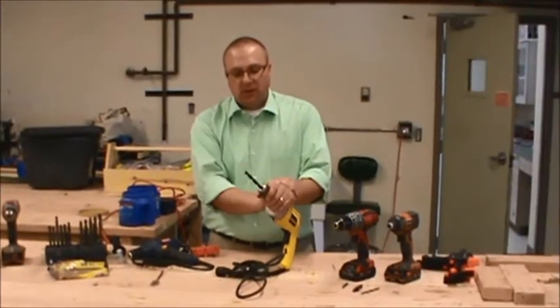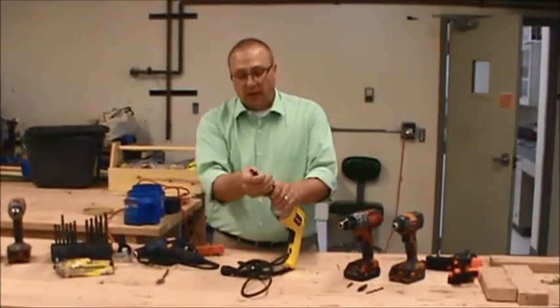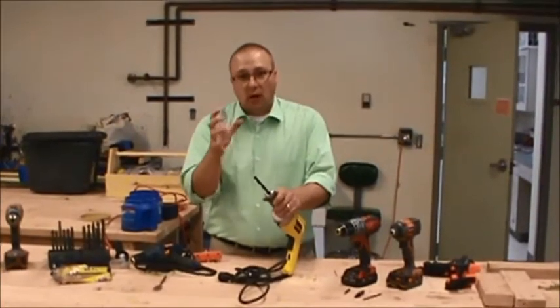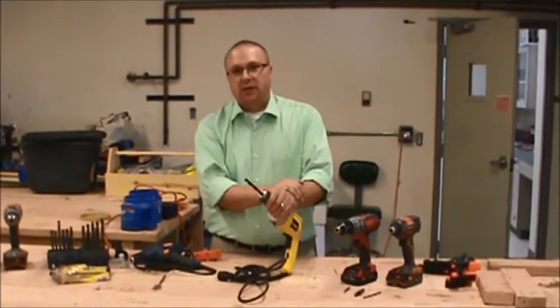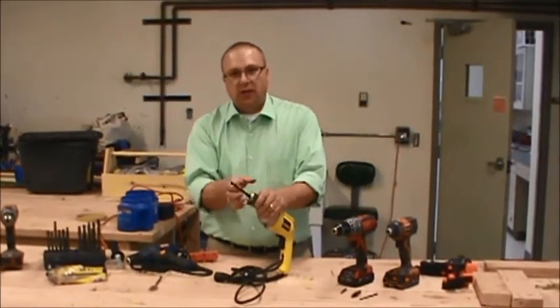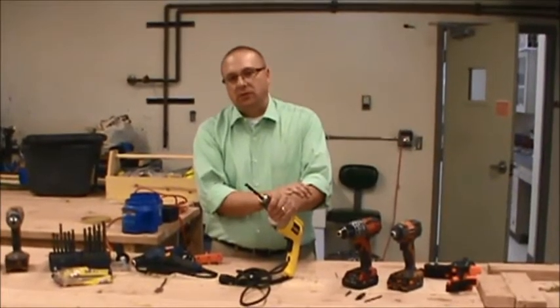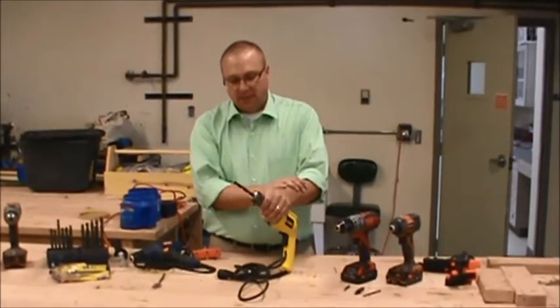And this drill bit that we're going to use today, you want it in there nice and snug. If you have really large drill bits, you really want them snugged in there because you don't want to get partway through and have the jaws let loose or loosen up and that come back. That could be really dangerous. That's a way to break bits. That's a way to get yourself hurt in various aspects of that.